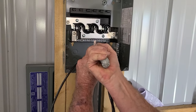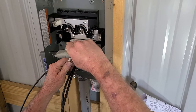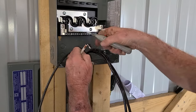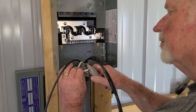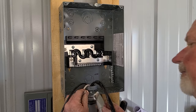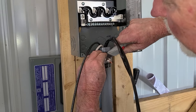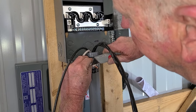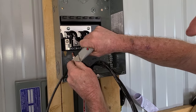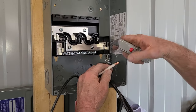You'll want to angle your cut on the insulation. It's too big to use wire strippers on anything bigger than number 10 wire, so you have to use the utility knife. The power is off — we've already checked it, and it's never been installed at the other end, so things are safe. I can safely touch the bus bars here. Make sure all of your insulation is off — any remaining insulation would cause troubles downstream. Try not to nick the wires; that's why I'm cutting at an angle. With an angle it's also a stronger transition from insulation to bare wire.